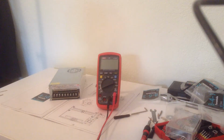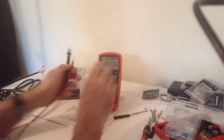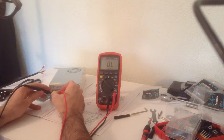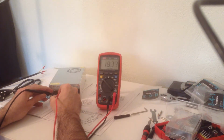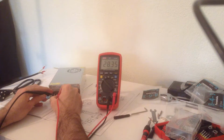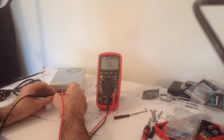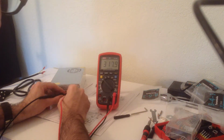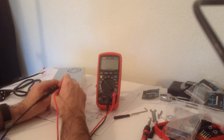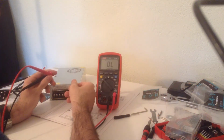About the power supply, before we plug it to the mains, we're gonna check a few things. We're gonna want to check there's no short between live and neutral, which would be a bad sign. No between live and earth, or neutral and earth. We're gonna want to check the output isn't shorted as well. It's not. You see the value increasing here because there are capacitors in parallel, and they're getting charged as the meter is checking the resistance, but they are not shorted.